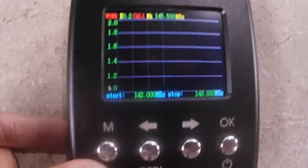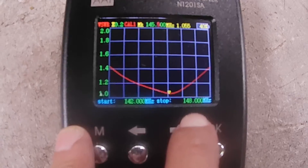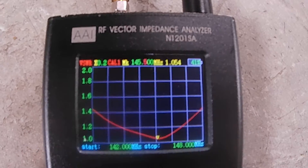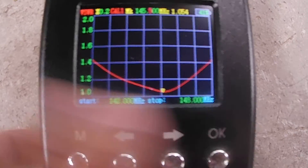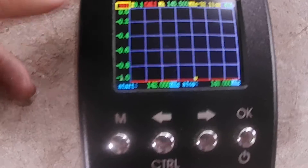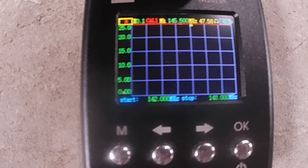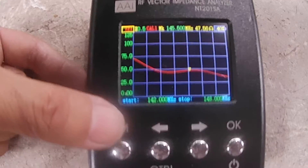Let's check the frequency curve on the antenna analyzer. As we can see, 142 MHz is the lowest frequency at the bottom of the screen and 148 MHz is at the upper end. The center frequency at 145.5 MHz shows the lowest dip at 1.05 to 1.1 VSWR. The antenna return loss is minus 32 dB, reactance is 0.7 ohms, resistive load is 47.56 ohms, and impedance is around 47.58 or 48 ohms at the lowest frequency dip.